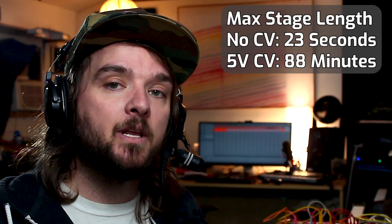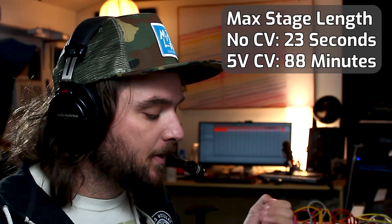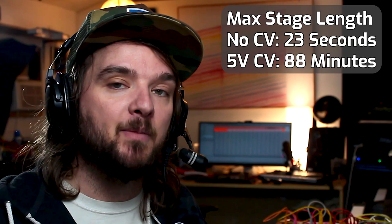That might not sound very long, but that's without CV. Once we add 5 volts of CV, each stage can go all the way up to 88 minutes. So we can get a super, super long envelope. I'm not going to do it quite that long in this video. I am going to use some CV and extend the range a little bit, and I'm hoping we're going to land around 5 minutes. That's my goal: the whole envelope, attack to release, is going to take 5 minutes.